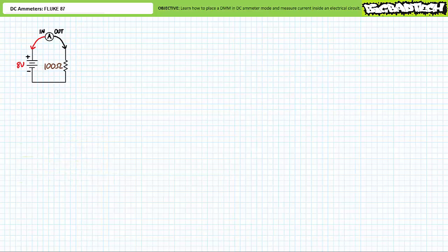Since proper placement of the ammeters seems to be the skill that eludes most first-timers, allow me to spend some more time hammering this subject. By all means, draw a picture and talk yourself through it. Think how conventional current flows through the circuit.